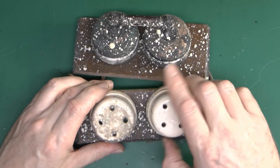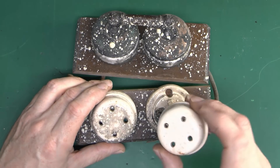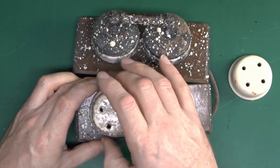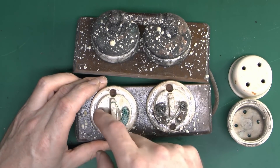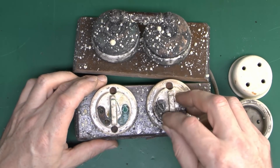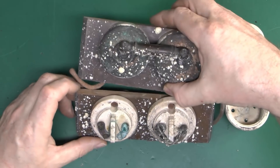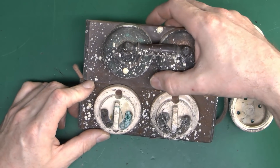These things, which hopefully will unscrew, are basically porcelain threaded holes in the top there. And then here is your fuse — or in the case of this one, rather a nasty mess of fuse wire. And again we can see the fuse wire there just between the two terminals. Obviously someone's put an extra large amount in here to avoid things failing — one problem with rewirable fuses. Although it doesn't look like it, this is actually a fuse box, and that would have originally been into a single piece of timber, which has obviously cracked open with age.